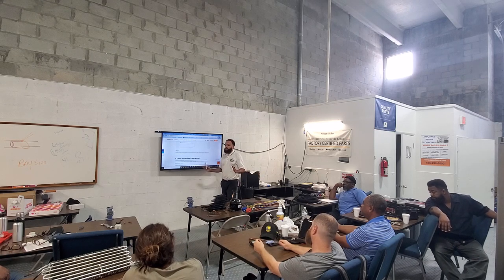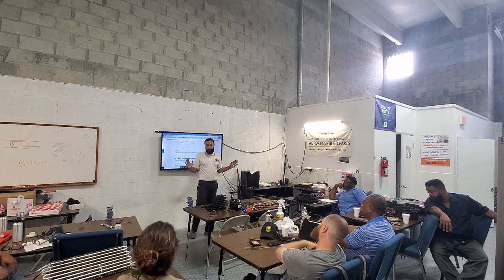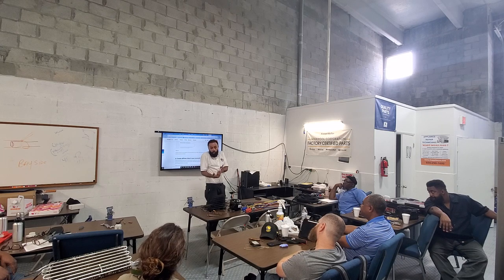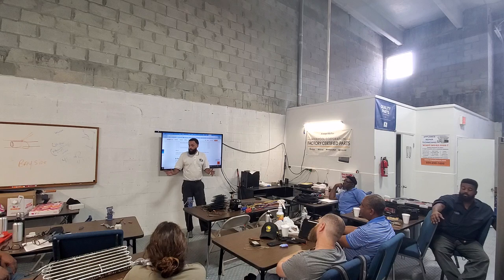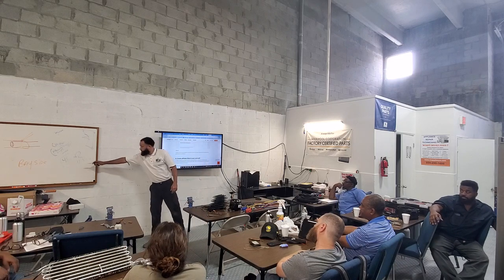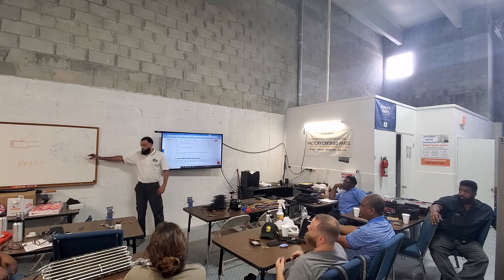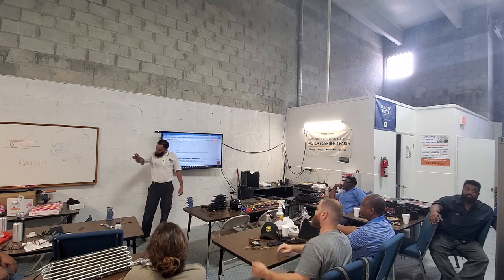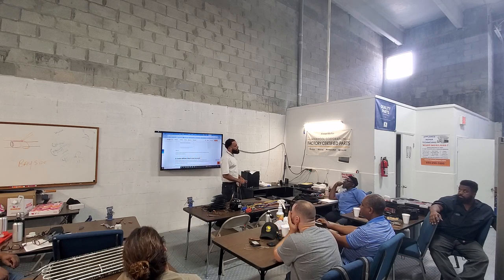What continuity tells me is that from point A to point B, I'm okay. What resistance tells me is exactly what's going on and how much resistance I have from point A to point B. Everybody with me? That's the difference between the two signs. These two are your best friend. When you go out there and you have an open fan motor, this one's gonna be your friend. Okay? We went off on a tangent.